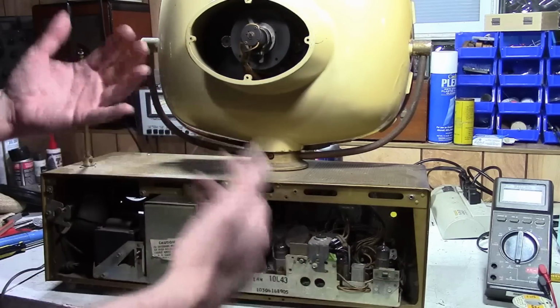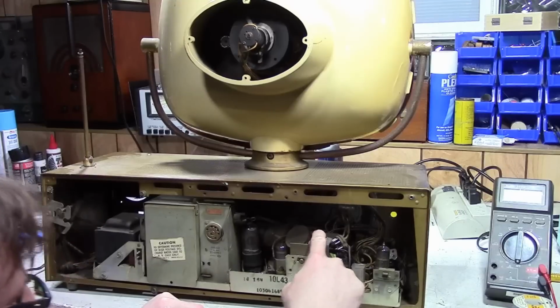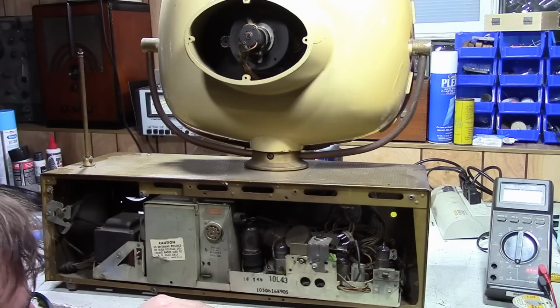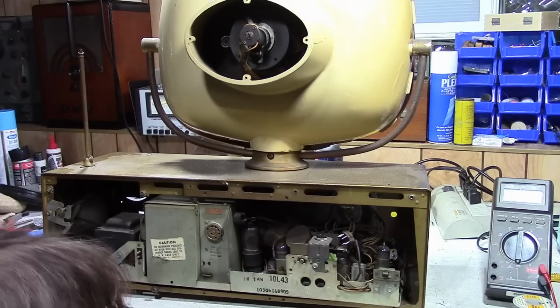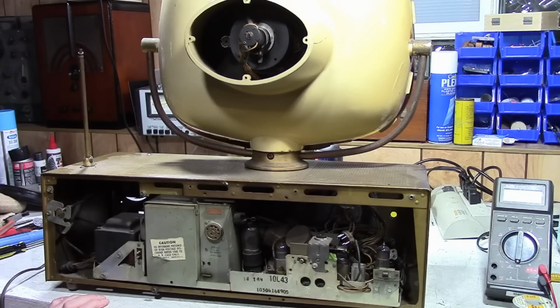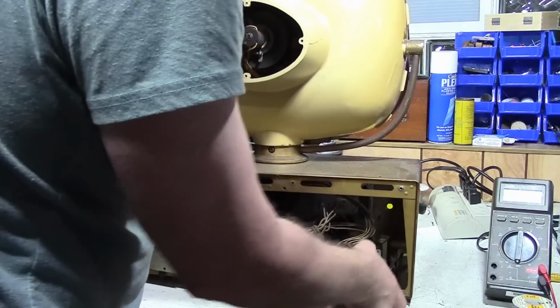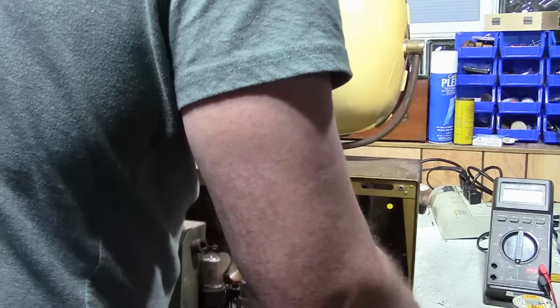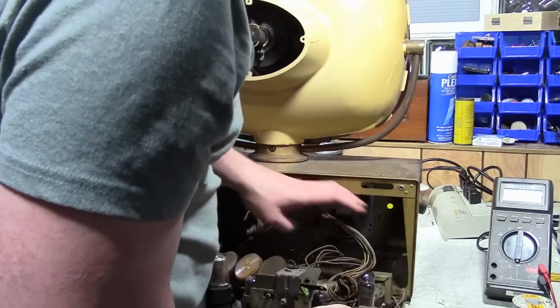So when you want to take one of these apart, just briefly, there are some cables coming down from the CRT, the swivel CRT. Plugs in here, one here, and then a high voltage line. I think I've got all those out. Connections to the speakers I plug up front, and there's a control harness here, and a tuner which I appear to have taken out. And also there's enough slack on the wires you can kind of start pulling it out even without everything being completely disconnected. But yeah, that's what I thought. I left this in a state of being disassembled.